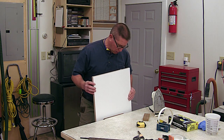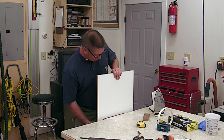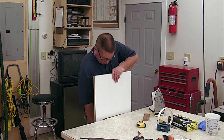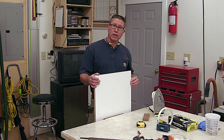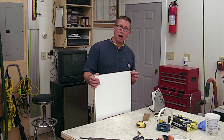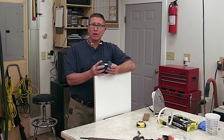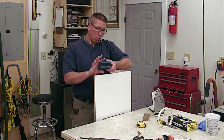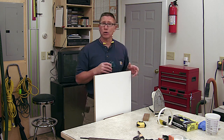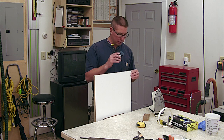Okay, I'm going to flip this over and put the second piece of edge banding on. Now, one of the things that you have to be conscious of is when you did this first piece of edge banding, that it's completely shaved off and filed off so it doesn't stick out at all, because no matter if you use the fast cap edge bander or a chisel, once you rake it across this other end with a piece of edge banding on it, you might chip it off. So make sure that you've completely cleaned up this edge so that nothing catches it when it slides across.